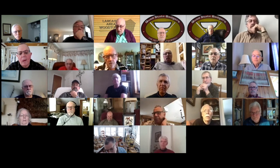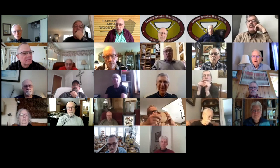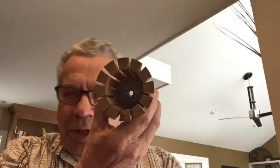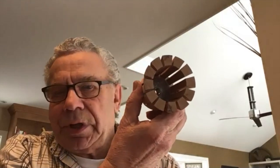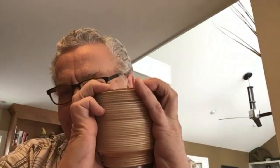Barry. Just me being me, I have a video, but we're kind of out of time. Basically it's like a shuttlecock with 12 segments to it. The free diameter is 2 1/8 inches, so I made a collet chuck and the other diameter goes down to 1 3/4. You can see it's got a taper to it, and the first 3/4 of an inch of this is tapered. So it goes in there, and then you run a 3/8 threaded rod through your headstock, and tighten it up with the wing nut on the back, and it compresses on down.